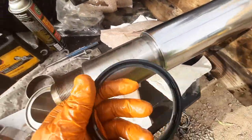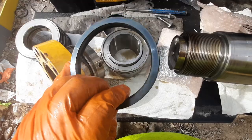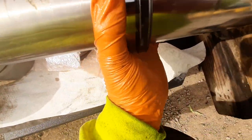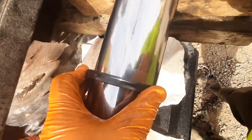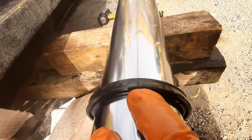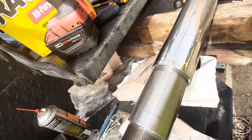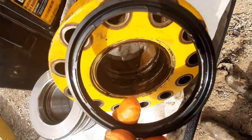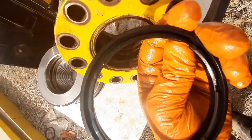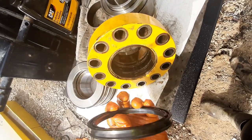This is your gland seal — it has an open ring. When you slide this gland seal on your rod, you want the closed end facing forward into the gland, and the open slotted hole facing the oil pressure side. What happens is oil comes in and spreads that open seal, actually pushing it against the rod even tighter, allowing a proper seal to take place. Make sure the open end faces the compression side of the gland.